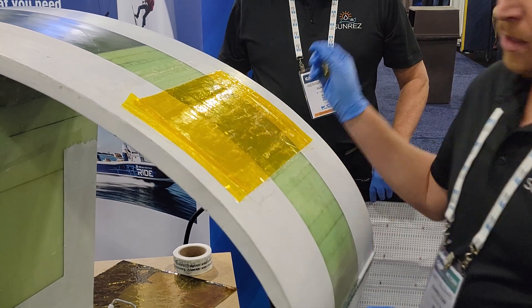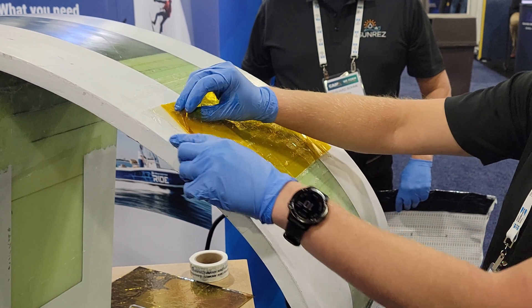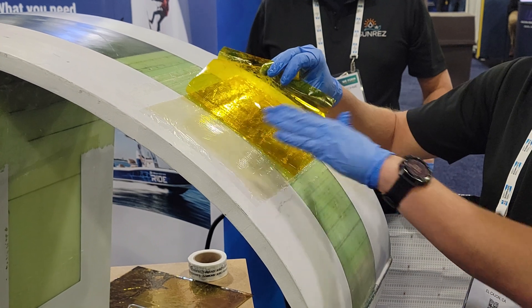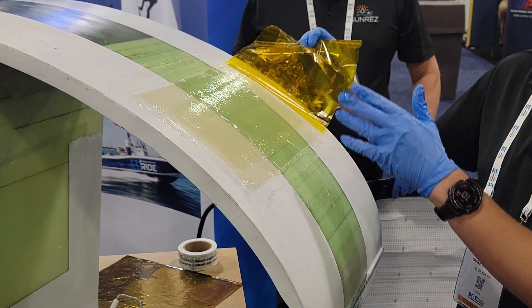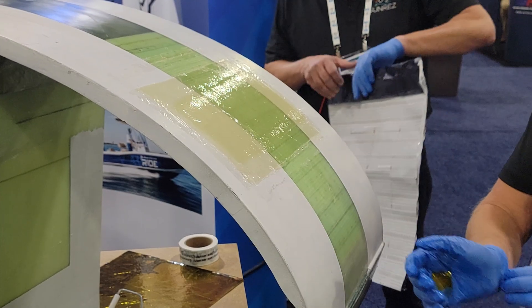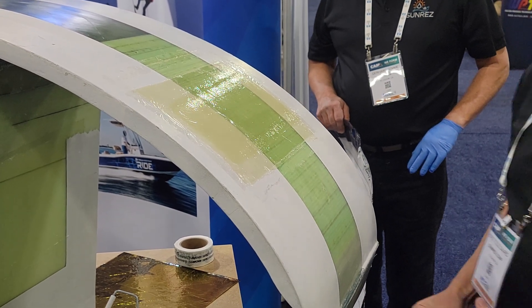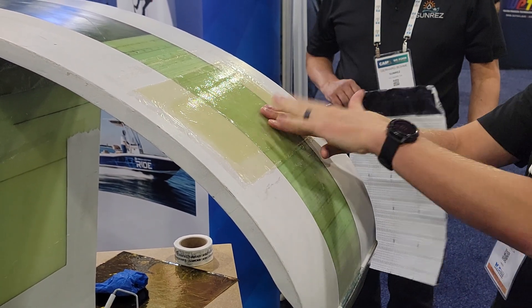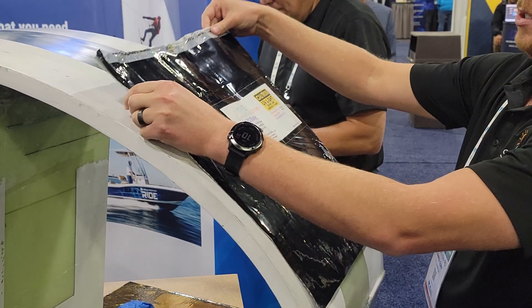To cure the section we're going to remove the orange UV blocking film and we're going to keep the clear film on. It usually helps just to hold one section at a time because there's a light spray adhesive between the two films. That way when you're working outside and wind pops up it's not just going to prematurely expose your part. We're going to leave the clear film on because it's going to create a tack-free glossy surface. If you were going to build multiple layers on top you could actually remove that, cure it — it'll have a little oxygen inhibition — and that way when you put your next piece on you get an even better bond back to your surface.